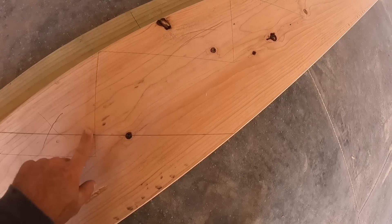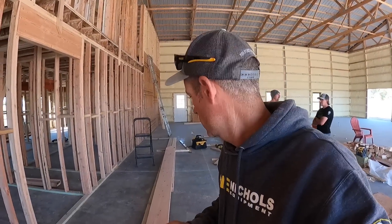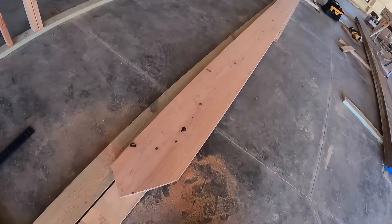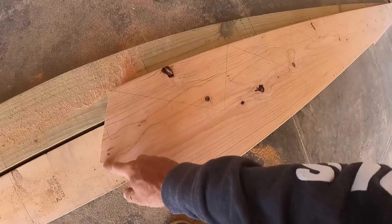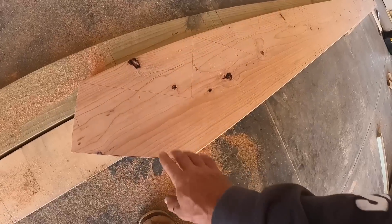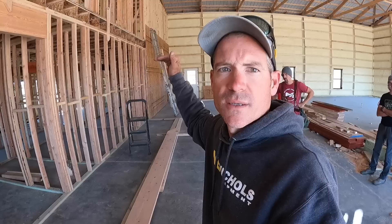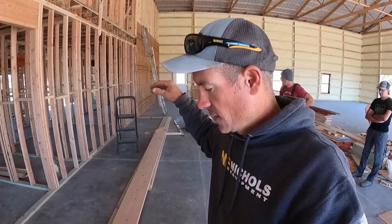Now I can cut this board and manufacture it three more times. Step one: figure out your run and rise based on overall run and rise. Used calculator.net to get all specific dimensions, set up the square, marked them out, subtracted tread height from the bottom one, and got that cut. Before cutting all of them, I like to do a test fit just to verify — it's not necessary, but I like to do it just in case I screwed up, which never happens, right Jake?